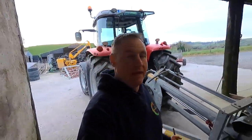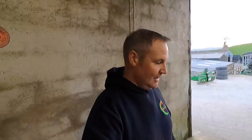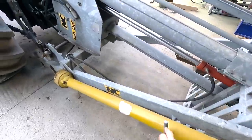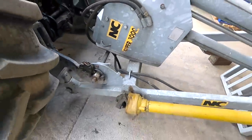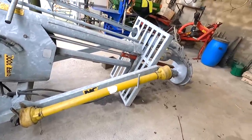It's the cheapest thing you could put into a machine, and it's going to save you a world of money in the long run if you look after just a little bit of grease here and there. It's vital. So I've done the shaft, the Hardy Spicer, the connection, and the rotor in here behind the plastic, another important thing to do, and it keeps the shaft in good condition. So that's ready to go.